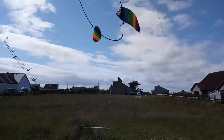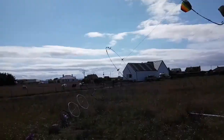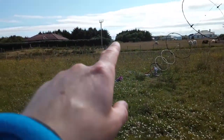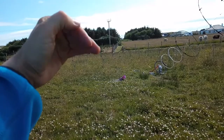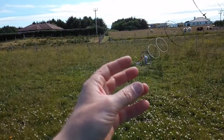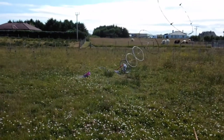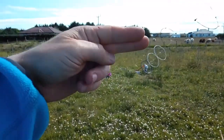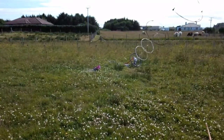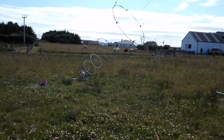One thing to look out for is to make sure that upwind of you — and it's quite bad here — those trees that are quite close by: as the wind comes over them, it gets all churned up and it's really very lumpy wind in this field, so it's not very good for generating. If you can, get a nice spot with no trees there — clear to the horizon if possible. Probably unlikely in Austria, but see how you go.